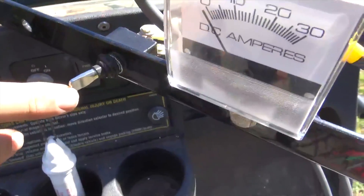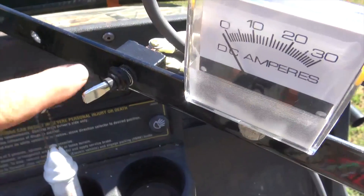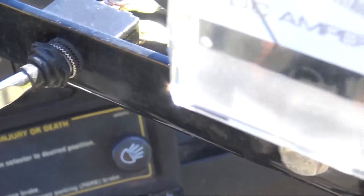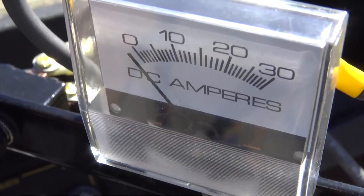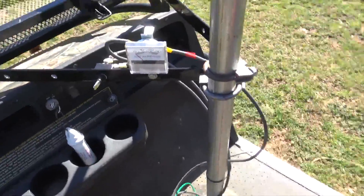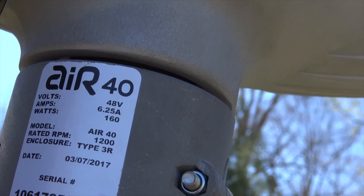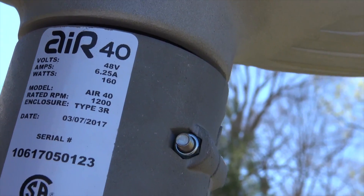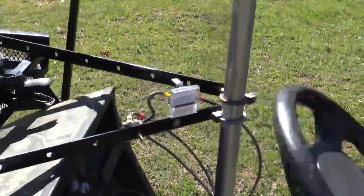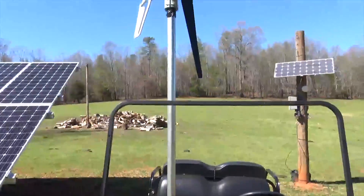We have the tried-and-true flux capacitor here from O'Reilly Auto Parts — the part number will be in the description. We have an ammeter to prove we're actually putting out some amps and making some juice. It's a 48-volt golf cart. The turbine is rated: 48 volt, 6.25 amp, 160 watt, model Air 40, rated RPMs 1200, made in the USA. I'm going to go pick up Elijah — he'll be my co-pilot and we'll do some testing.